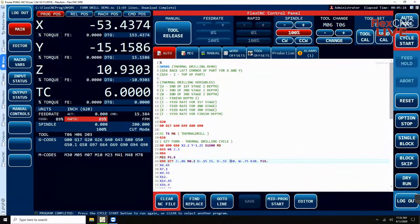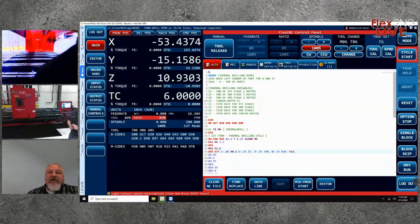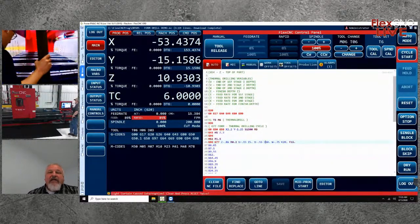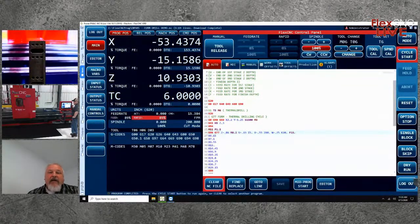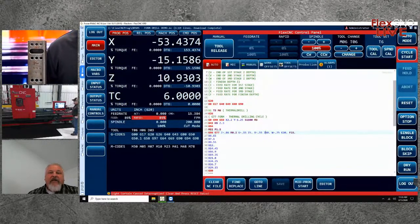Sure. What we want to do is start out relatively slow with the operation of the flow drill. We want that material to have a chance to develop some heat initially. So our first contact with the part is generally around 3 or 4 inches per minute. Then we gradually increase that as the material allows us to. As the material starts to soften, we advance the flow drill bit a little quicker. Our intent is to get in and out of the material as quickly as possible. We never want to hesitate once we start a cycle. So when it comes down, we want to get in and out of that material as quickly as possible within reason, starting off slowly, allowing heat to generate, and then advancing as it lets us.